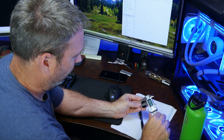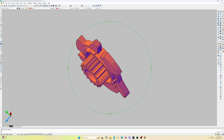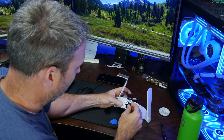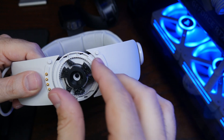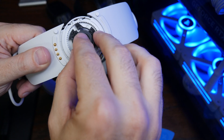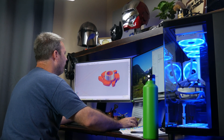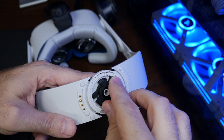With that decision made, I pulled out my calipers and started measuring, and after a few hours of work I had a model that looked pretty good. I queued it up on my Bambu Lab P1S printer, and a short 20 minutes later I did my first test fit. As anyone who's done this before knows, it would take a miracle for a part like this to work perfectly on the first try — and as expected, things did not quite fit right. I went back to AutoCAD, made adjustments, printed again. It fit a little better but still needed more work, so I went back a third time, tweaked things, and somewhat to my surprise, the third time was the charm — the part fit and operated perfectly.